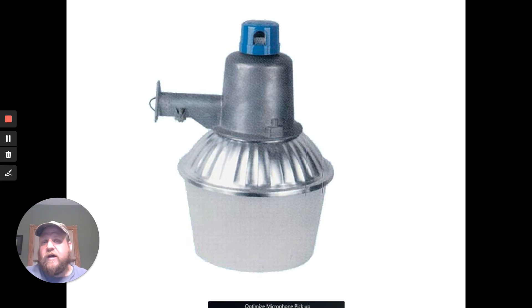There's your standard floodlight. Notice on top that blue thing — that's a photocell eye. It should be pointed toward the east so that when the sun sets the light turns on, and when the sun comes back up it shuts off. Follow the directions on your electrical hookups. My grandpa had a new yard light installed and was down in the basement going 'I think that new one's 220 volts.' That mercury vapor light was really bright — and then all of a sudden it wasn't. Not 220 volts, grandpa, I guess not.